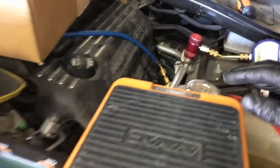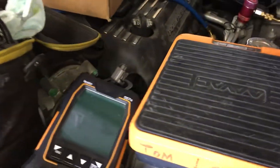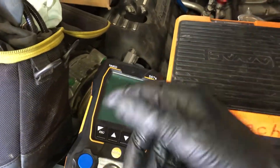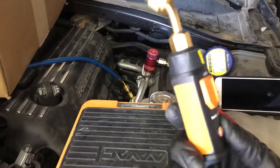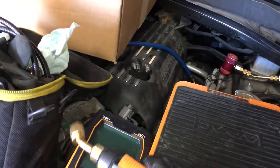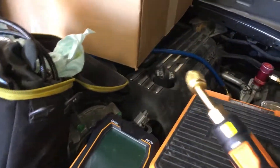This is why having a micron gauge in the system, or at least at the gauges — you can turn it off right here and read it in the gauges. But the Testo 557S doesn't have a micron gauge inside the system, so you can't read anything. You have to revert to putting a T in, making another possible vacuum leak. On a good system, if you were really serious about drawing a vacuum, you would not use gauges — you'd use a straight hose.